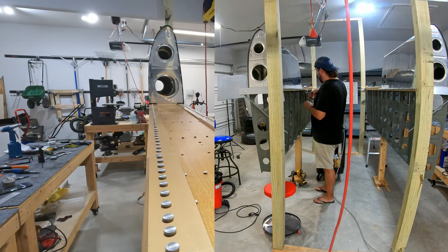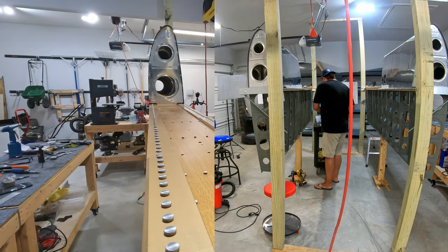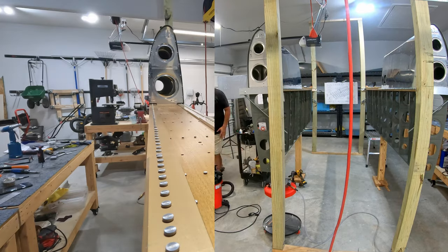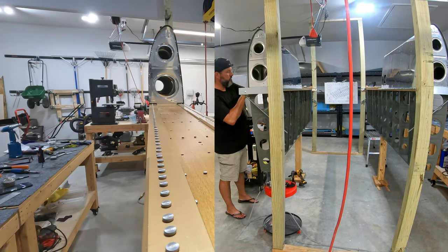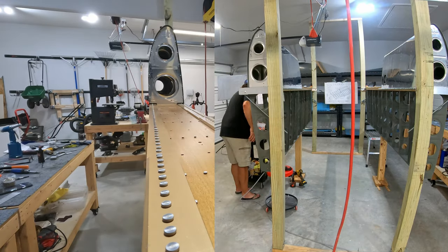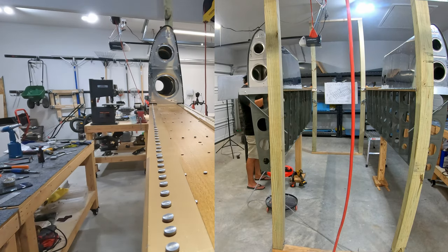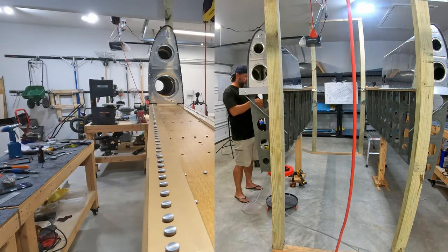There are a handful of spots where a rivet goes through the skin, through the spar flange, and then through a rib flange from the main rib. Those ones are 0.5 longer: AN426 AD3-4.5. You need to be mindful of that when doing a bunch of rivets so you don't just blast through and do them all with the short rivet. What I ended up doing on the other three sides was to do all those longer rivets that meet the main ribs first, then go back and do all the shorter ones.